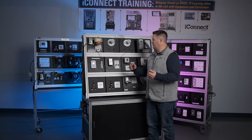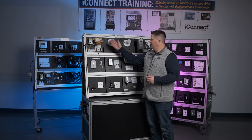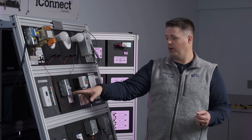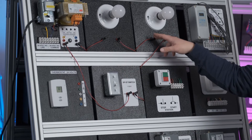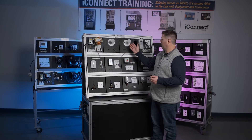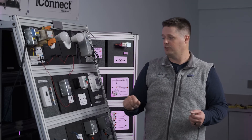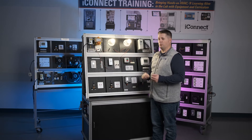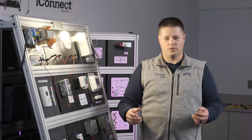Your transformer panel is your power supply. We start off on the 24-volt hot side, come down through our single pole single throw switch, out of the switch in series to two different light bulbs, through the light bulbs, and back to the transformer. If everything is wired correctly, power is on, fuses are good, and circuit breakers are not tripped — as soon as we flip the switch, the circuit completes and the light bulbs come on, simulating a two-light-bulb series circuit.